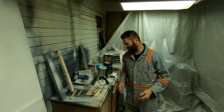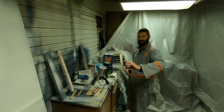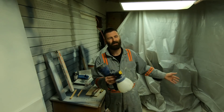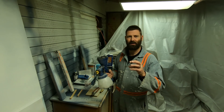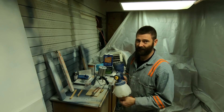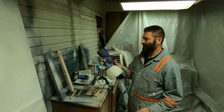We are in a different room of the workshop — I call this my spray room. It's far from a spray booth, but it's a smaller room, easier to control the temperature and exhaust the air out. This is where I've been spraying for the last couple of years. I have an airless sprayer, but that's not something you want to spray cabinets with. You can get special tips for your airless sprayer, but there's a ton of paint tied up in the hose and those things are a real pain to clean. I don't like getting out my airless unless I absolutely have a massive job.